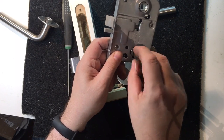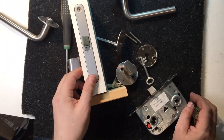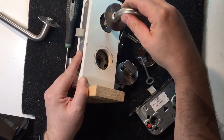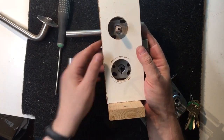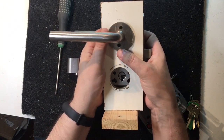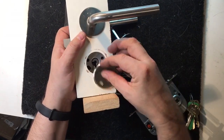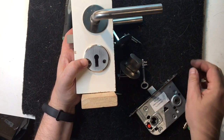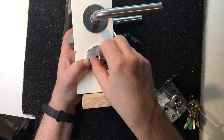There is no way this lock provides any means of safety — it's just a privacy indication. By default, this one comes with a door handle, as we do with all our locks in Denmark. It has two holes that go through the lock, and then we fit a handle on the other side with just two screws that go through. For the keyhole, there's another set of covers that also has two screws going all the way through, with some nuts on the inside. Then we insert our key and we have our lock.